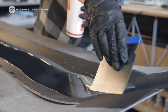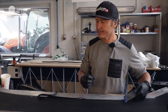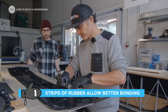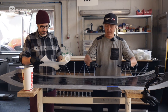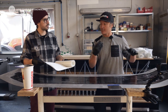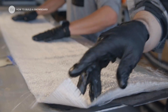First we're going to spread out all the resin, and then put this rubber on the edge so that it bonds better — it needs to go beyond the edge. So we're going to have four layers of fiber to lay down. That's the base, we've got the resin, and that's going to be a fiber that's unidirectional — one direction — and then we're going to play with other directions to work on the flex the way we want.